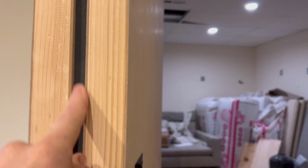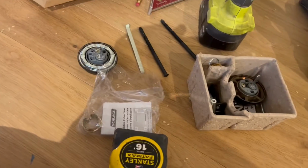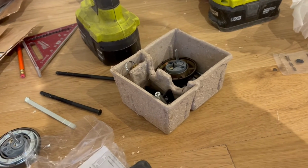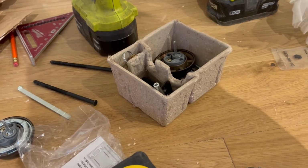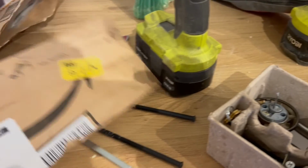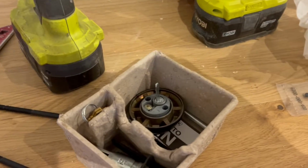Our two doors and the foam between give us a 4-inch thick door. That's not going to work for a standard lock. So you can get what's called a thick door kit, but those typically accommodate a door up to 2¼ inches. If you have something bigger, it's a special order. So this client ordered something.